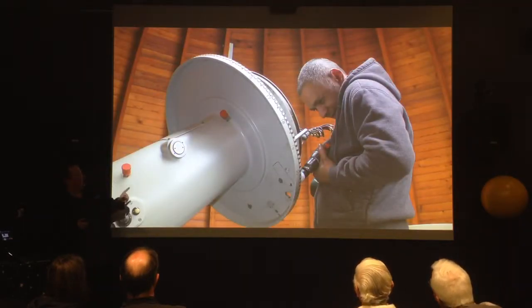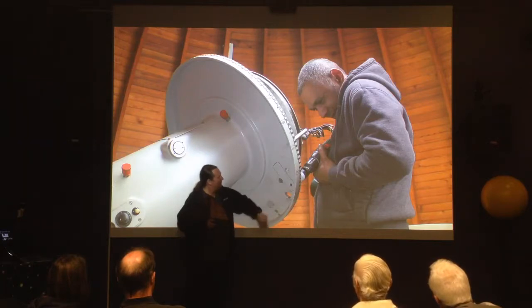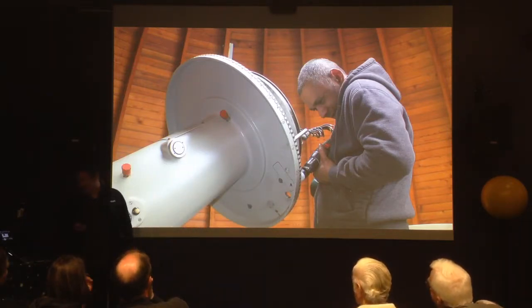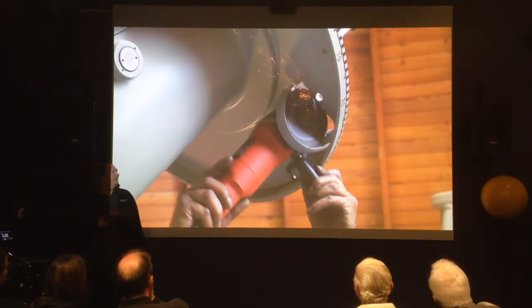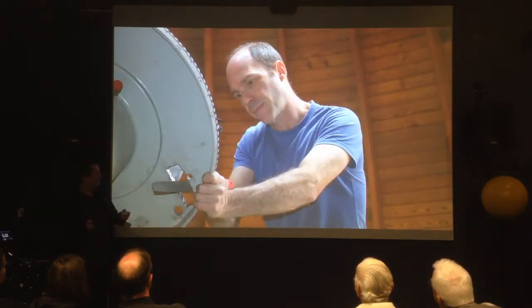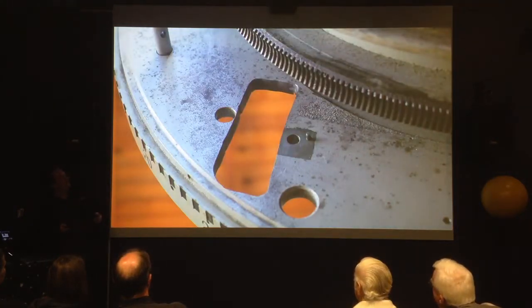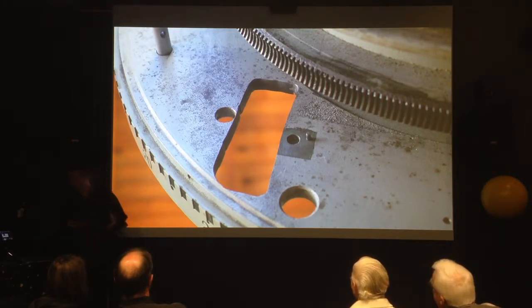Here's Raj with tool number one — a cordless drill and a hole saw. See how thick this cast iron is? It's not easy to cut by any means. So tool number two was a high-power electric drill, then tool number three was the angle grinder. Whilst the other axis had gone off to Pekaranga Engineering for high-tech six-axis mills, this was a little bit more manual. Finished off by tool number four — Andreas and the file. The end result, despite that agricultural approach, was actually a really quite nice hole.